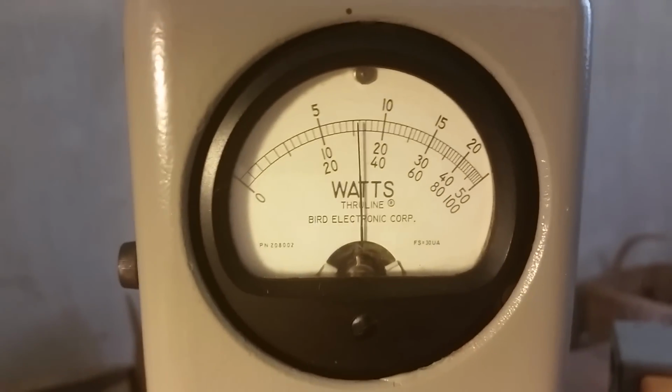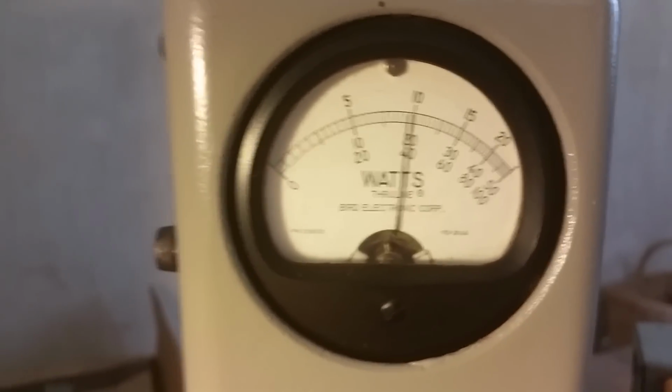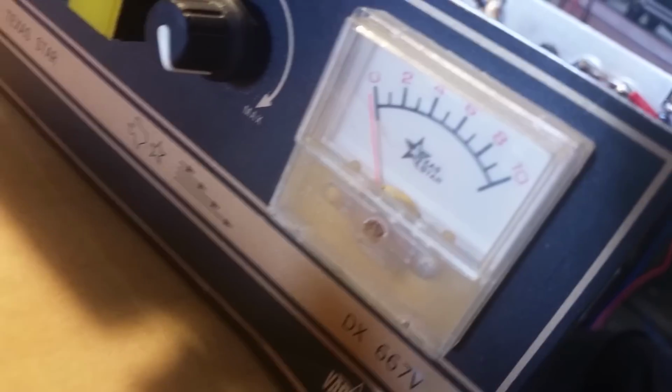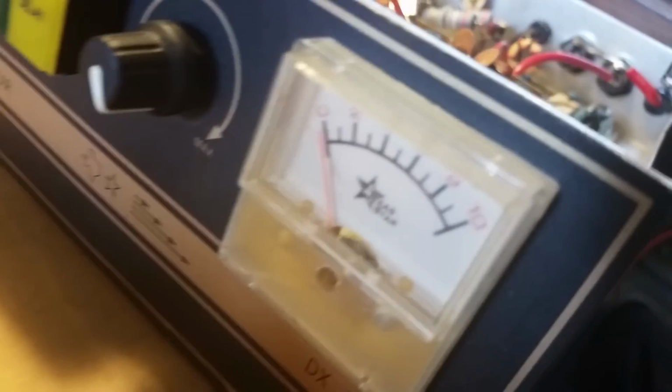Switch over to peak. Oh, yeah. It's about 410 watts. Let's see the front meter there. You can even see the front meter there is indicating that it's only doing about half power, just relative. All right, and we're going to double our input power, from driving 4 watts RMS to 8. Let you see, there ain't much of a change, but there is a little change.